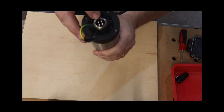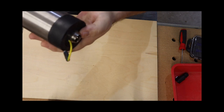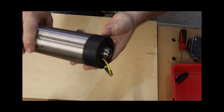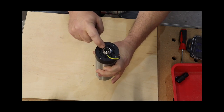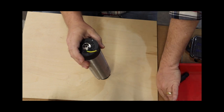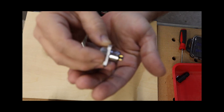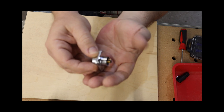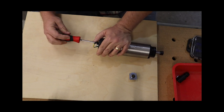The first thing that has my attention is the standard socket that's part of the spindle. I just don't know how far it protrudes into the housing, so this could end up being a very short video — we'll see. I've got to disassemble the top plate and pull that out, because underneath here is the fan that provides air cooling for this unit. This replacement connector has about a half-inch protrusion down into the body of the spindle, so I first need to make sure there's going to be room in the spindle housing to accept that.